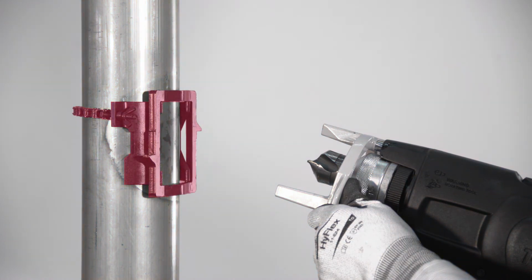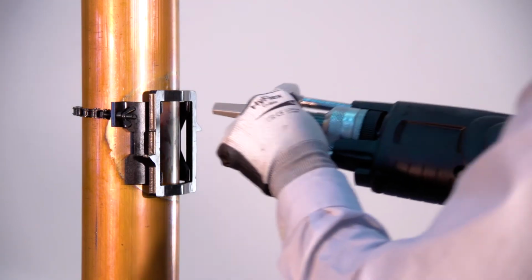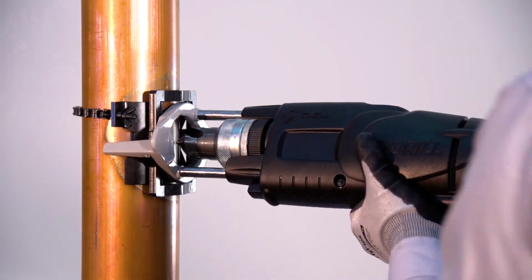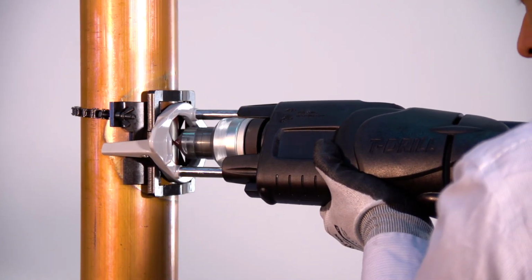Also, counterplate is needed when working on 2.5 inch or larger mains. The chain and wing nut secure the counterplate on the tube. The notches in the tube support correspond with the tabs on the counterplate. Extend the legs out. Secure the T-drill on the counterplate, matching the tabs with the notches, and drill the pilot hole at high speed until the T-drill head penetrates the tube wall.